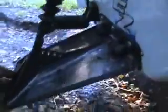If I can do this while holding the camera, all the pressure builds up. You see that? The actuator slides right back. So when the boat starts to move and the pressure comes, the water pressure builds up here. It's hitting this tab, and then it's just going to give you that lift you need from your boat.